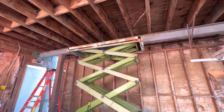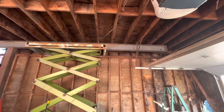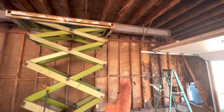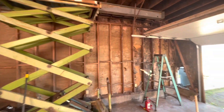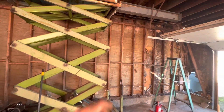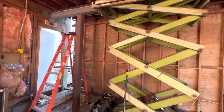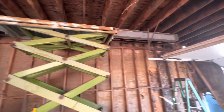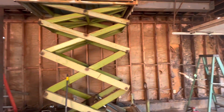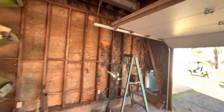We're putting new joists in and getting this ceiling joist area supported again with our beams. We're going to knock this wall out, disassemble it, take it out, and save the wood — a lot of that's decent two-by-fours. Get this wall out, get the new wall stood up, and temporarily set the roof back on it until we're ready to rip it off. That'll be the next project, but we've got to get this wall up to support the new joists — that's where we're at.